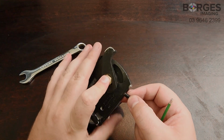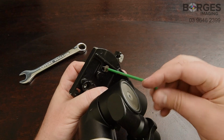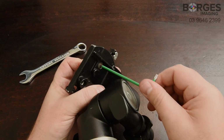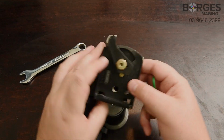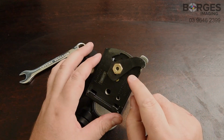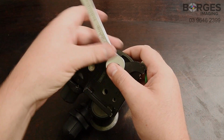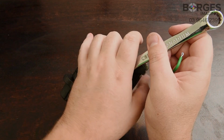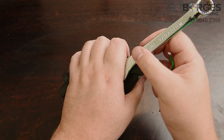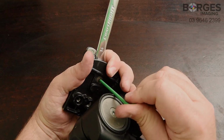Now you'll have to turn it around and put your Allen key in. And it's just a repeat of the first thing. So all the way in, turn it back one turn, tip it over, unclick the handle, push the dimple down, turn it all the way to its full lock position, put your 14mm spanner on, turn it half a turn, hold it all down. Usually it'll drop off and annoy you. Hold it all down, turn it over, tighten up the Allen key.